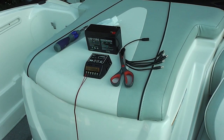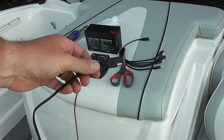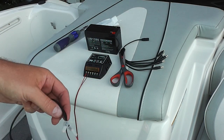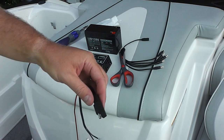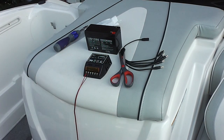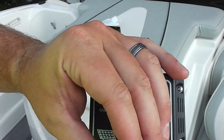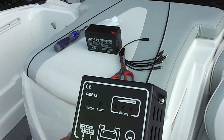This is the other end of the cable, and I'm going to bring it over here. Now, this is called an SAE-style plug, and the solar panel that you can find within this video's description came with a few extra SAE plugs. As you can see, I simply wired them to this DC wire, which you can also find in the video's description. So now when I connect this, it'll turn the solar panel on because this other end goes to the solar panel. And that's a visual acknowledgement — that green light over charge. That indicates it's getting sun power.